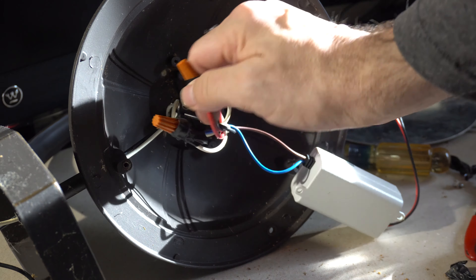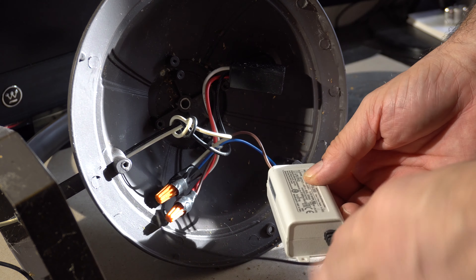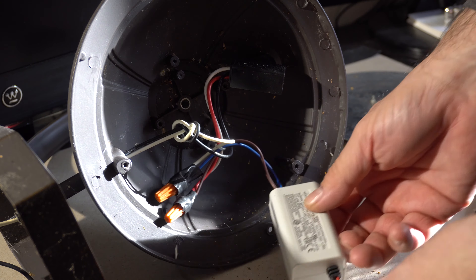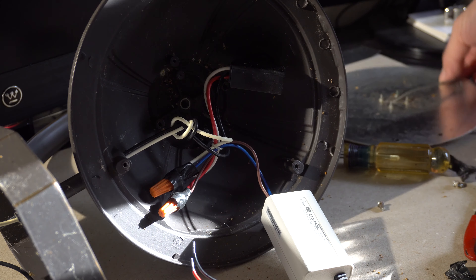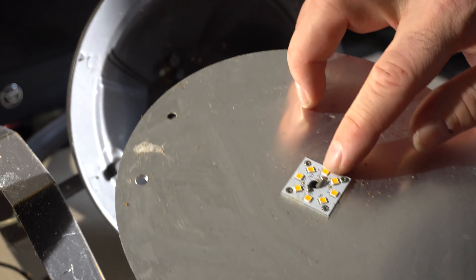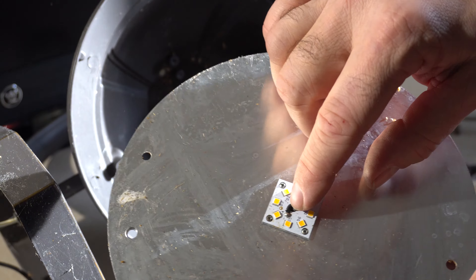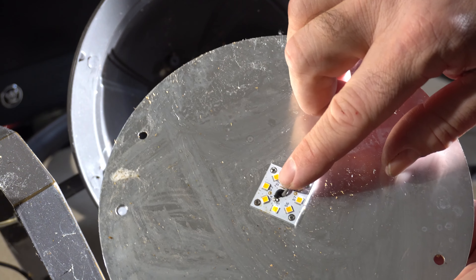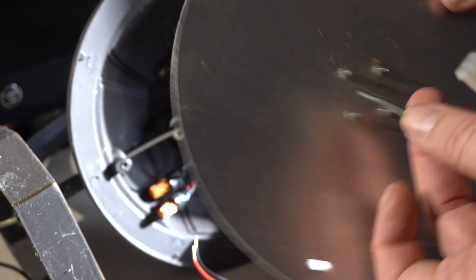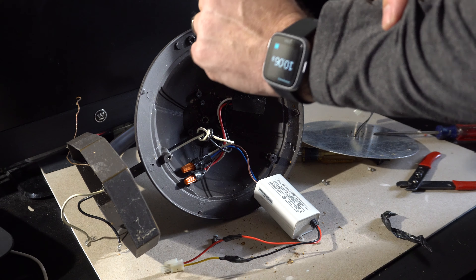On the low-voltage side I actually had to cut the connector off the old power supply and reattach it — it's simply a matter of rewiring it the way it was wired. LEDs require that polarity be correct: make sure you connect the red to the positive, which is marked on the board. The LEDs wouldn't light at all if you got that backwards.